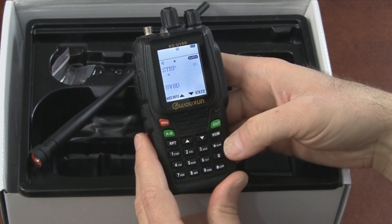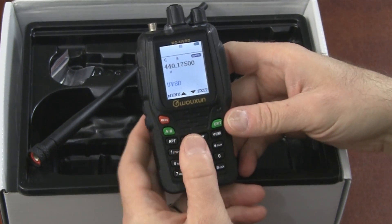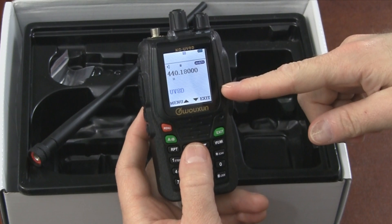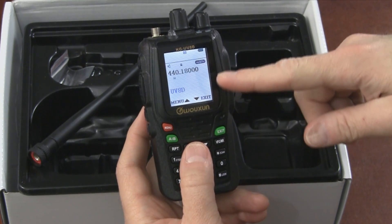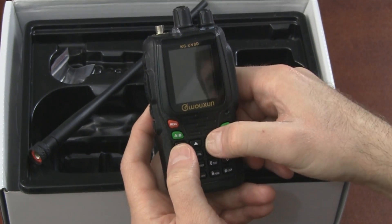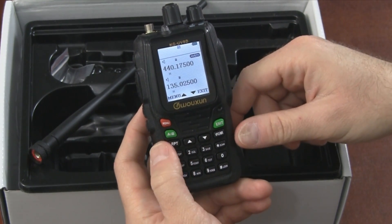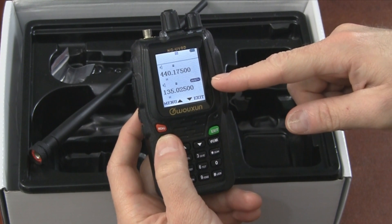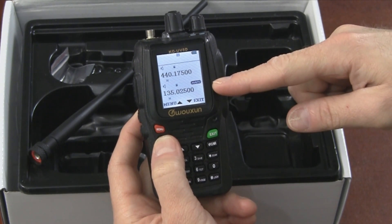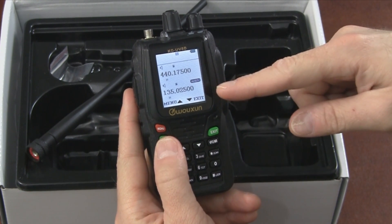There are a lot of choices in the menu, and we reach reset at the end. There are two areas on the screen like most dual band radios, so you can set a frequency in area A and a frequency in area B. We're now in dual work mode — you can see there are two frequencies. There's a main icon showing which area you have selected, and when you press the talk button to transmit, your transmission goes out on that frequency.